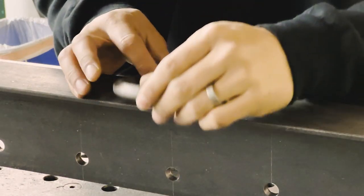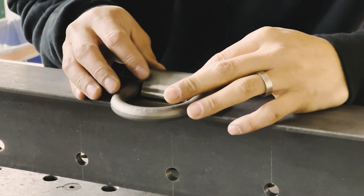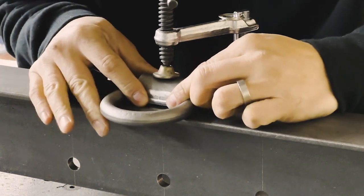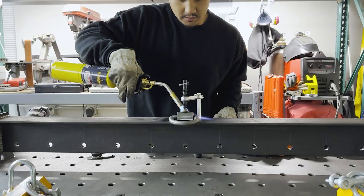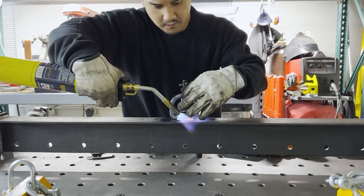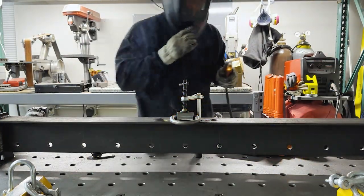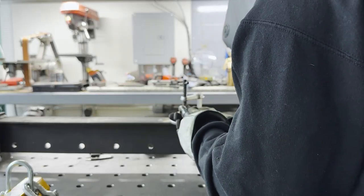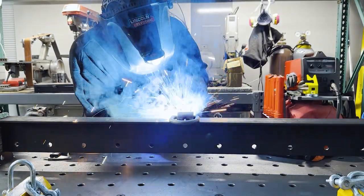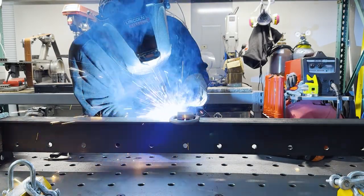Here I'm using a D-ring — a non-lifting one, but it's rated for around 2,000 pounds non-lifting. The steel I'm going to be lifting maxes out at probably around 700 pounds, so I figured this D-ring should be fine. I've seen them on other builds, so I decided to weld it in. The D-ring itself is about five-eighths thick, which should be plenty for what I need.